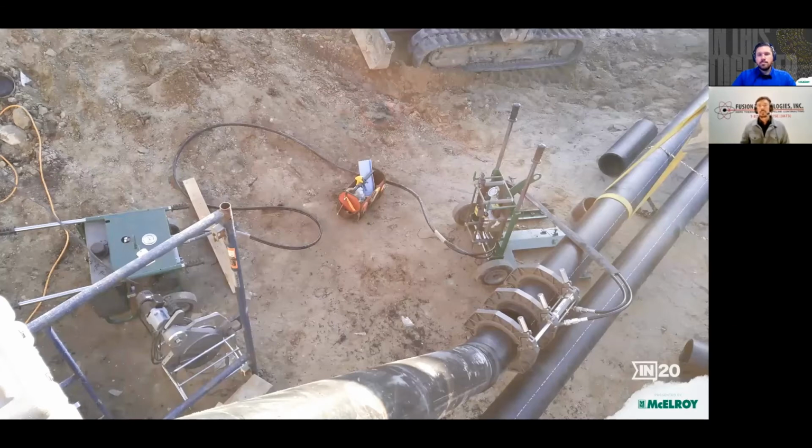Literally, there are some slide pins on the sides of the inside static jaw, and you pull them back and swing those arms out of the way, and you can separate the 3 jaw from the base plate and the 4th jaw in like 5 seconds. It's very cool.